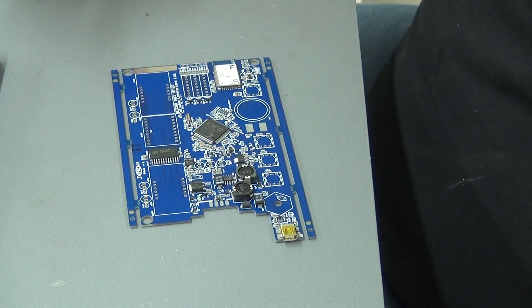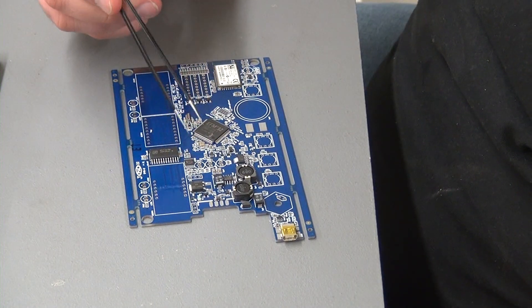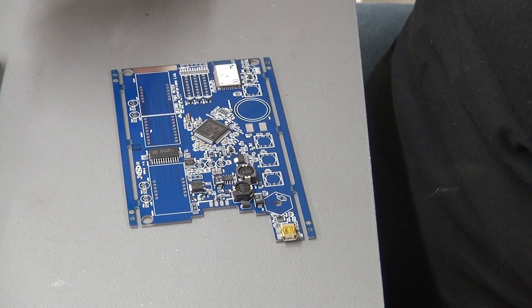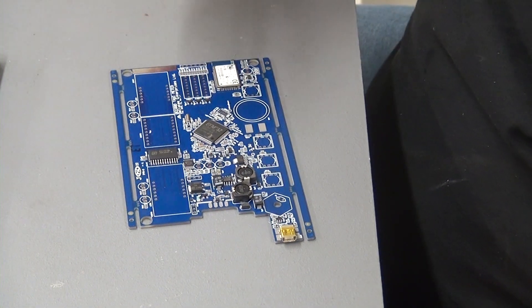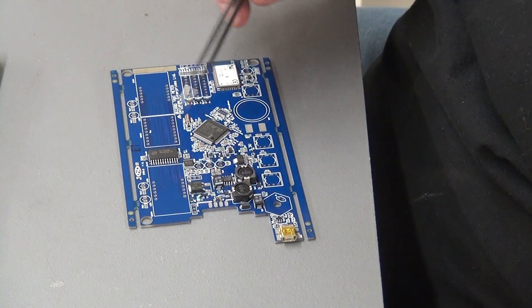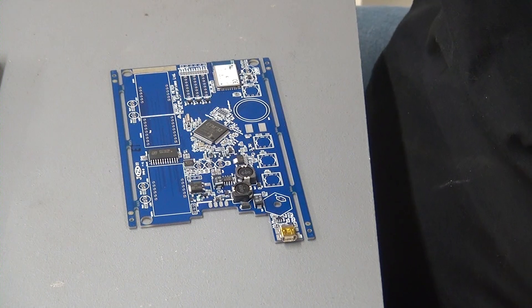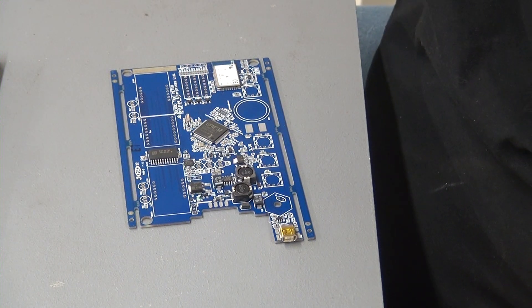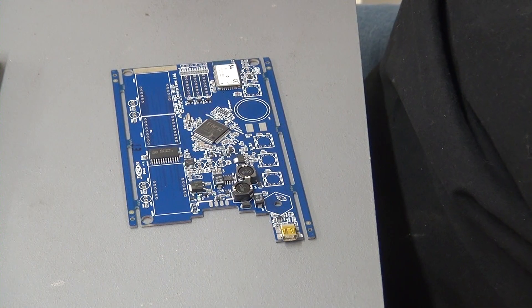So that there has all the components that were to be placed on it in the machine, placed by hand. What we do beforehand is always do a nice quick visual inspection — make sure everything's lined up, or at least as lined up as we can get it. The Bluetooth chip and the processor are the critical ones; a lot of the other stuff sometimes has the ability to float around, but most of the time the components find the pads and just adhere. So what we'll do now is put this in our reflow oven.